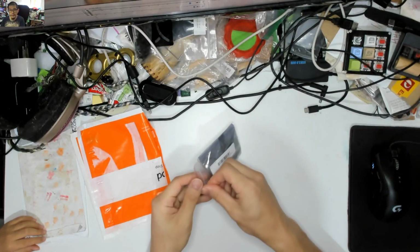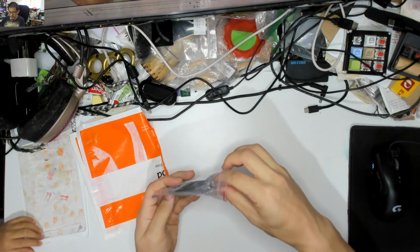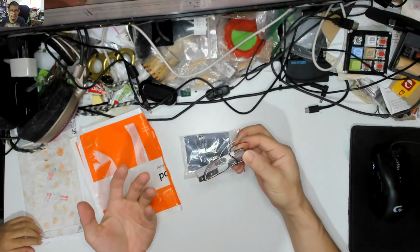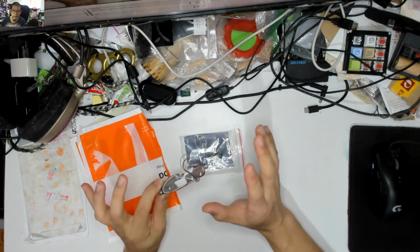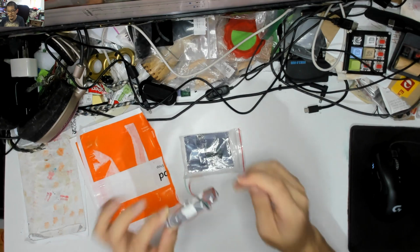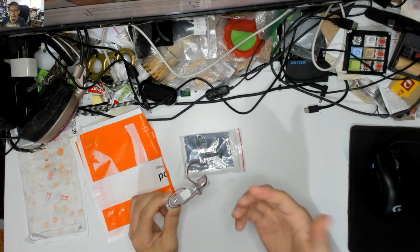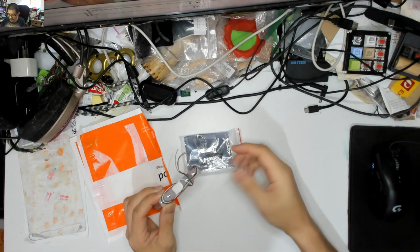Now I chose the lightest sensor. This is a 1 kilo bar, because 1 kilo is in excess of what our mechanical keyboard switches are going to experience. So it should have no problems whatsoever in being able to detect that. If anything, I don't know what the resolution is like for a 1 kilo bar, if it'll even detect the fine amounts of change that is required. It might not be sufficiently fine enough.